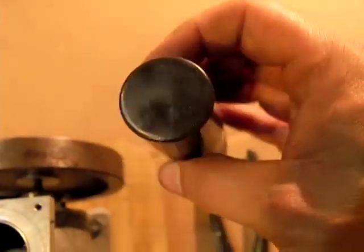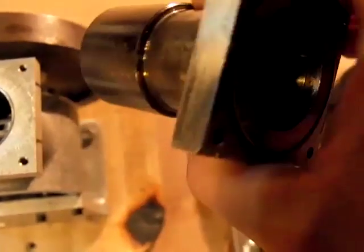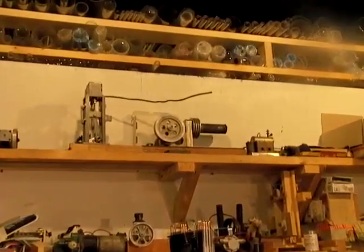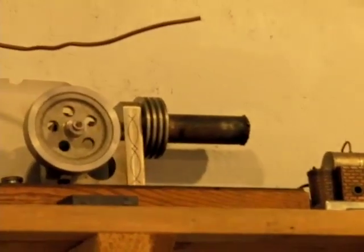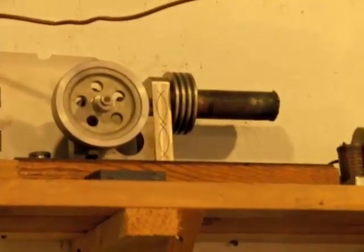You can see that this actually heated up — still in good shape. Now it looks like this was a steel cap put on top of there. There's a reason for that, I would assume, because it prevents you from having to do a weld up here. This particular engine, that weld at the end broke. So I've attempted to weld it back, but it's not working very well. I'm probably going to do the same method with a cap on the end.